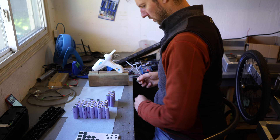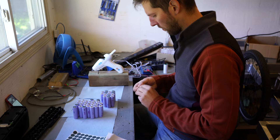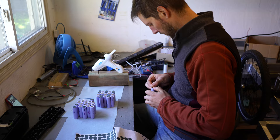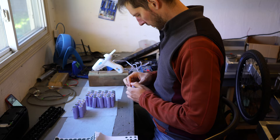I've got these green sticky insulator rings that I'm putting on top of the positive terminals of each cell. Each of these cells — the negative cathode is actually the entire cylinder and the positive terminal is only the little button on the other end — so it's very easy to bridge the positive and negative terminals. The insulator ring just helps prevent that unpleasant spark or explosion that will destroy your face.